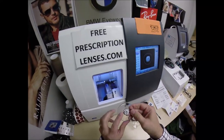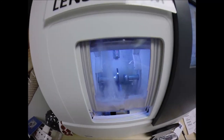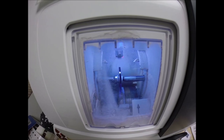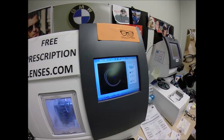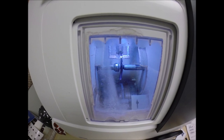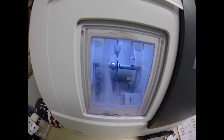Press the sticker on there firmly, place the magnet into the chuck, and hit the start button. The door closes, the clamp shuts, and the lens is going to be traced by two white styluses, making sure it's large enough to go into the frame. First go round. You can see it tracing the shape of the right lens. Then — the old carpenter saying, measure twice cut once — it's measuring the thickness of the lens at every point to know exactly and precisely where to place the bevel.